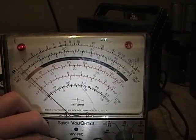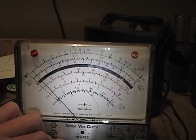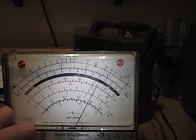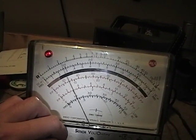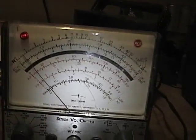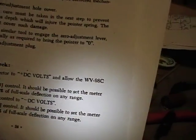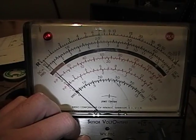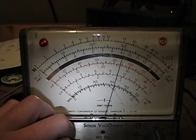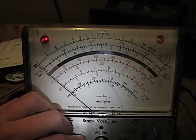I'll just drop down to another range — no problem. On the lowest range it's a little touchy, very sensitive, but still no problem. Now set the selector to negative DC volts — rotate the zero adjust control and it should be possible to set the meter pointer to either zero or 10% deflection. Zero — and deflection — no problem. This is a really good sign; it seems to be passing the first test without any trouble.